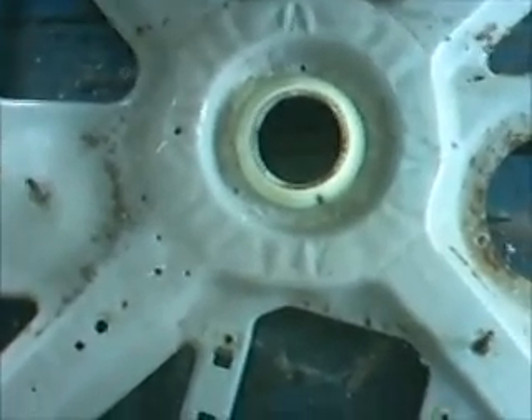On this unit it would go right into that hole, lay on top of that plastic ring. Hopefully you're not trying to follow this like a step-by-step guide, because I forgot to tell you: before you put on the part with the three legs on it, make sure you have your belt on there. Once you put the part with the three legs on it, you cannot get the belt on. Now putting on these springs — one end goes right to that hook right there, the other end goes to that right there. It's best to have somebody help you with this to push the drum to each side. Once again, you can't get the cat to help you with this. Now with the three springs attached, you can work on getting the pedal power assembly onto it.